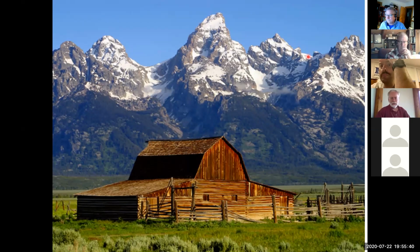Those that aren't nearly as experienced as the people on this call will frequently make the mistake of using the least common denominator. They find something that's a low strength species, and they'll apply that low grade to everything, and then they'll do all these unnecessary repairs because they don't consider that they have a lot of other sticks that may be a higher strength species or a higher grade. So when you've got mixed species, you've got to at least acknowledge, okay, what do I have here? What's the grade? What's the species? People I work with in the guild and on the council always consider that instead of just lumping it in and taking the least common denominator.